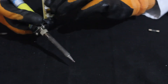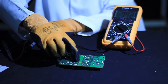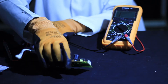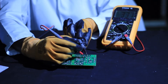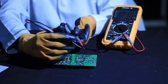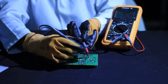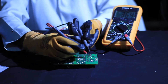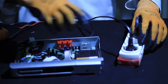After replacing the defective component with the corresponding one, you conduct after-repair testing by doing voltage measurements at different stages of the decoder power supply. You measure at the chopper transformer, at the rectifier to see if it responds correctly, at the filter — the main capacitor — and finally at the regulator. Once you finish the voltage measurements, you confirm the repair of the power supply circuit is complete.